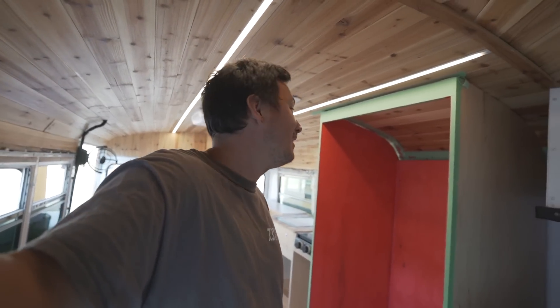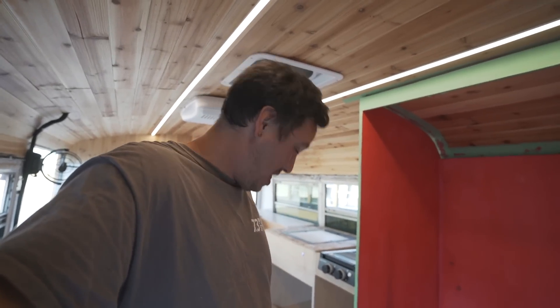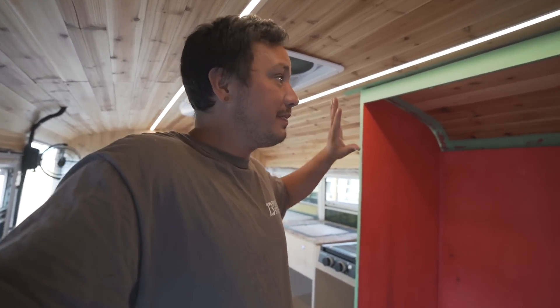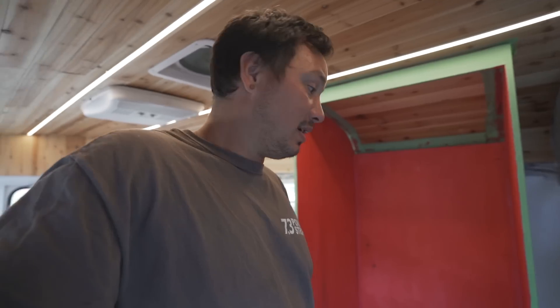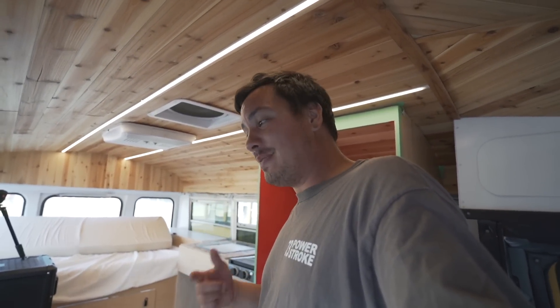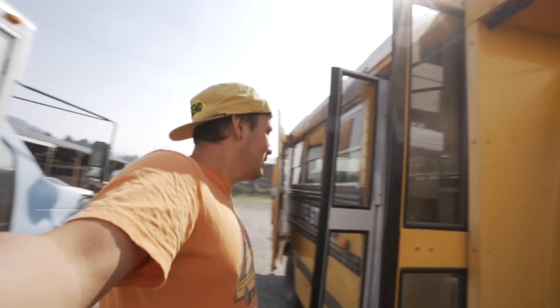That's it for the end of the work day. The shower stall is massive — you will definitely be comfortable in there. The stall is mounted and waterproof. We're going to let it dry overnight, come back tomorrow morning, hang the FRP up with contact cement, drop the pan in, and it's all done. I need to order the pop-out curtain rod and shower curtain. Took all day to do that stall but it's kind of a mission — hope you all learned something.